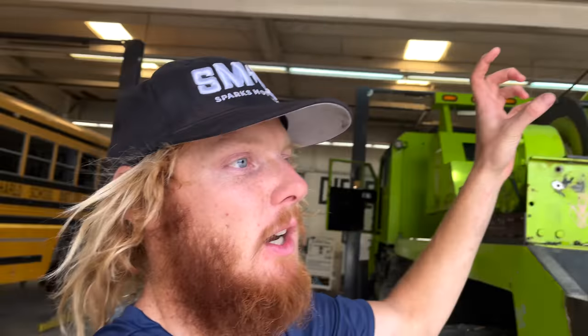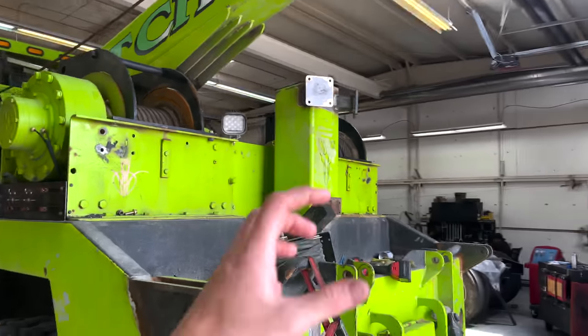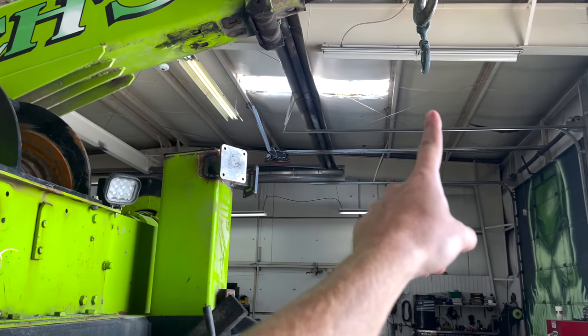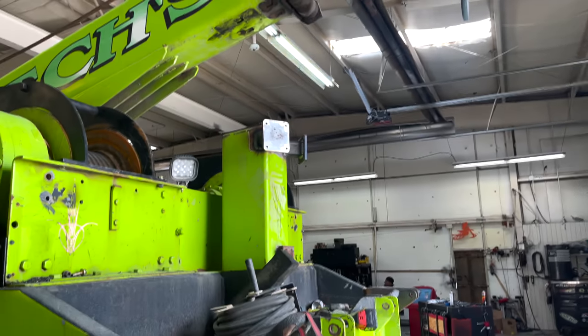And when we were excavating the Susan Powell mine, we were using one of these winches and we had a snatch block pulling the cable over so it was in center of the drum. And that snatch block was like 5 feet in front of the winch. And at that distance, the cable tracked on beautifully. So the goal is going to be to put one of those fair leads about 5 feet in front of this winch out in this open area here.